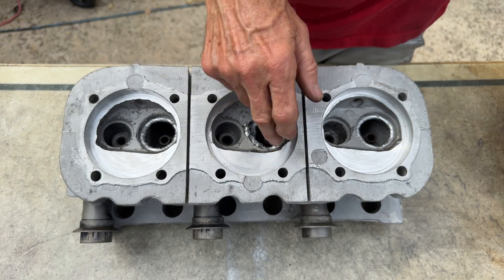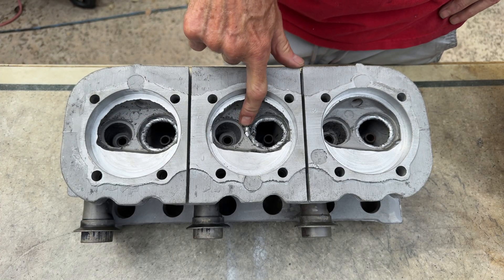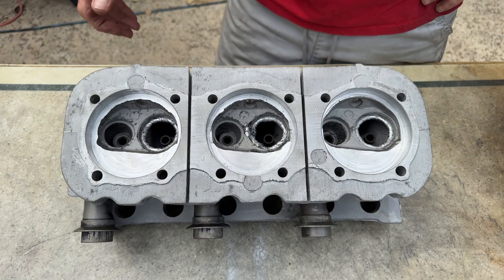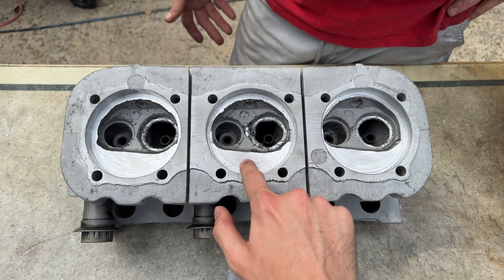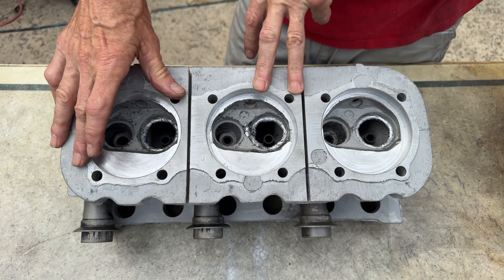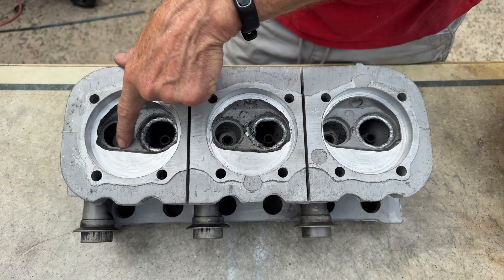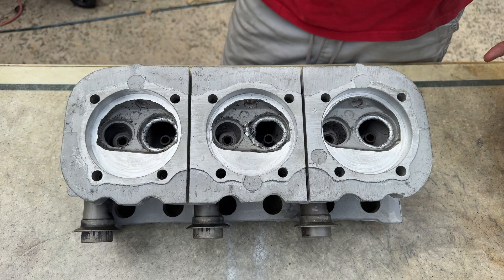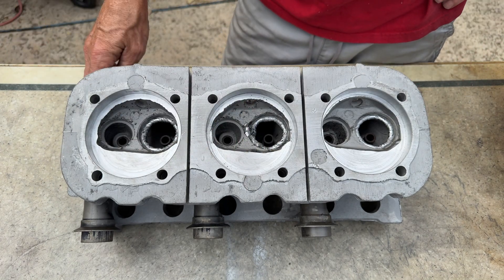It's going to have a solid copper head gasket. There's still some black down in here — had to weld this up a bit. It just had corrosion from water sitting. When people pull these engines out or leave the engine cover up, when it gets rained on, the water goes past the carbs, into the engine, fills up whatever cylinders have the valves closed and sits there. This one probably sat outside five years; some I've got that are probably 20 years outside and they're just trash — the ports are eaten up.